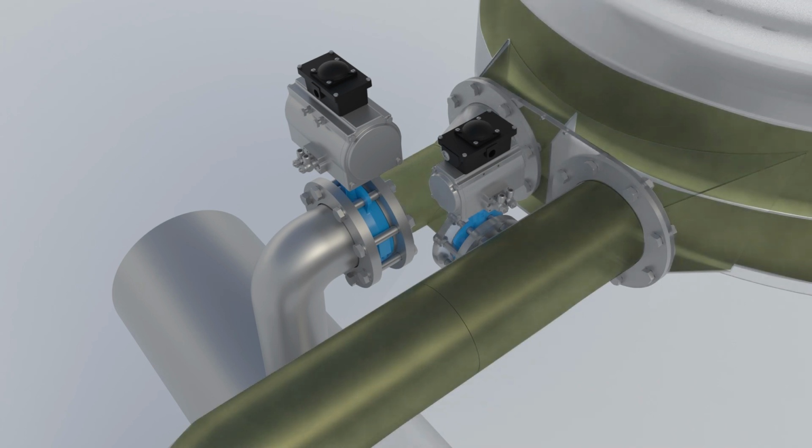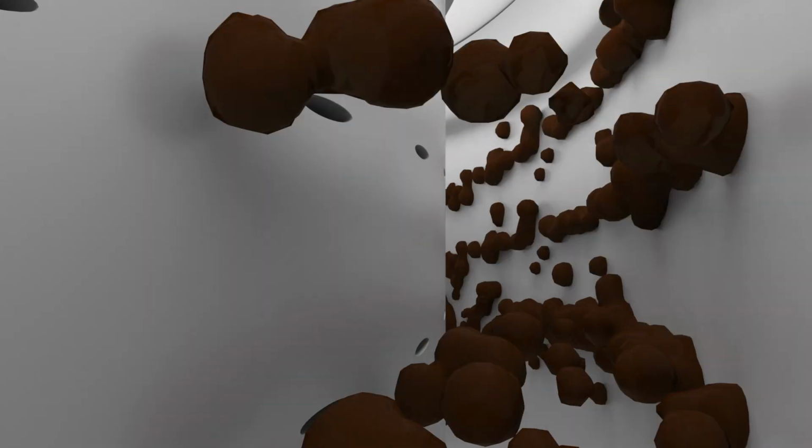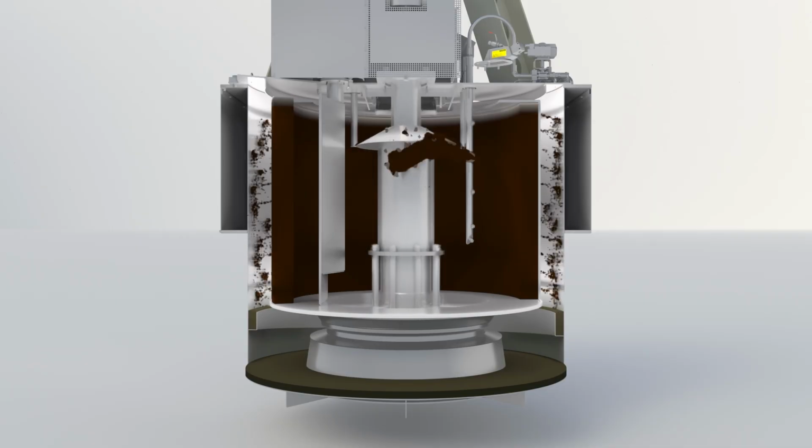When the basket is filled to the desired capacity, which is done automatically, the machine starts to accelerate with a high G-force value, which pushes the syrup out. The syrup leaves the basket by passing through the working screen, the backing screen, and through the elliptical openings in the basket. The video shows how the syrup separation system is automatically configured to evacuate the green runoff with no moving parts.